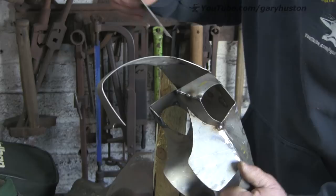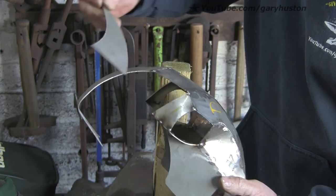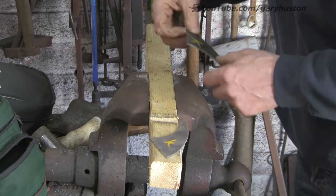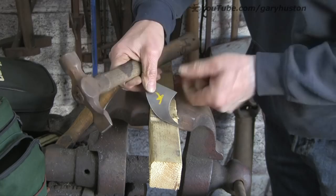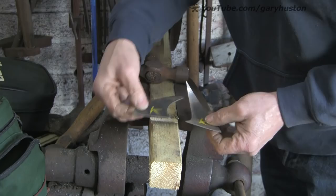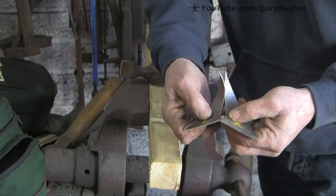I'm just taking out any of the little dings. Actually that's got to go that way around. So that has now got to have a little bit of a bend in it so that it can fit to that shape. So I'm just going to use the V in the 2x2 again, find the right hammer. And this again — so that's bent. Actually it becomes apparent it's too much. But this would be where a paper pattern would come in quite handy, because you could do a little bit and try it up against the paper pattern. So I'm really wishing I had made a paper pattern now.